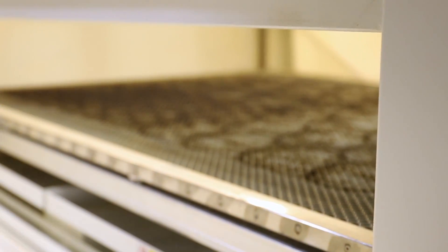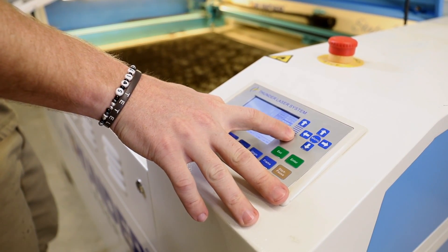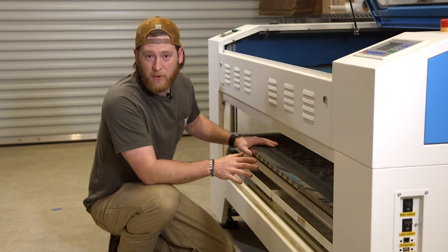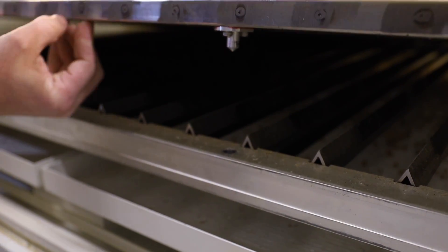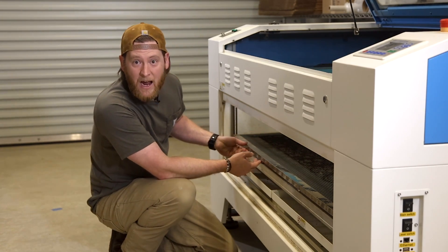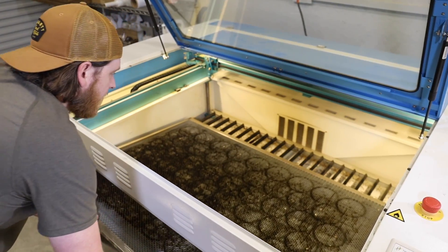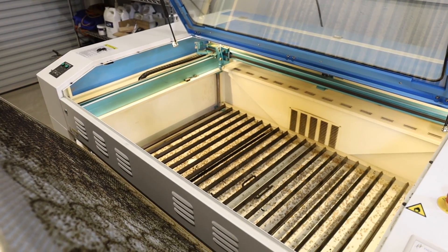To do so, take out your key and open up the lowest access panel on the front of your machine. Turn on your machine and lower your bed to about center of the opening. Before removing your honeycomb bed, familiarize yourself with how the bed is currently sitting. The honeycomb rests directly on blades and locks into the frame with two indexing pins for sturdiness, even weight distribution, and repeatable accuracy. Once you understand how it is seated, lift it straight out from the reference pins and remove it carefully without hurting the lens in the back.